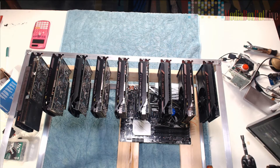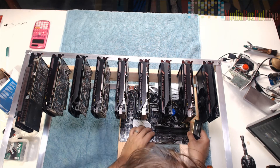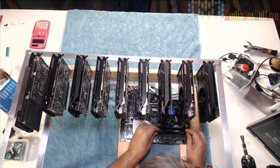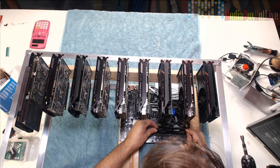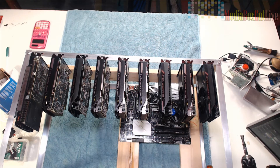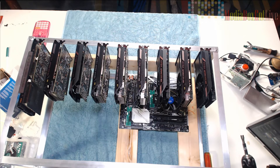When you install the memory - I installed it in the second bank on this board. For some reason with one of these motherboards, every time I install in the first bank it won't boot up and gives me a memory error. So I have to put it in the second bank - though I may have to switch back to the first. If you have any problem, if you see a yellow LED status light, just try changing banks. I only have one eight-gigabyte stick and didn't want to spend big bucks on memory, so just keep that in mind if you get that problem.